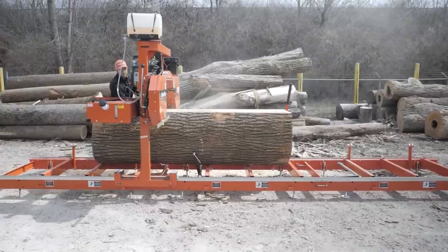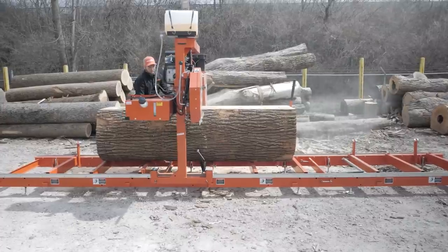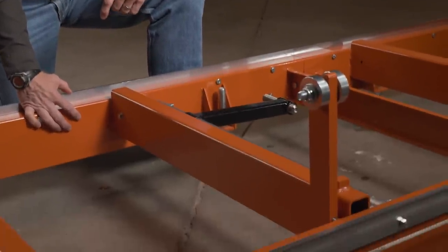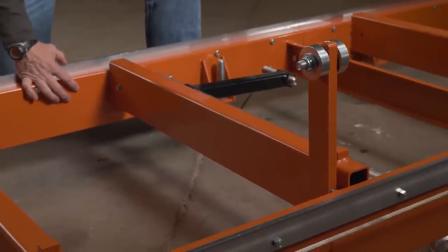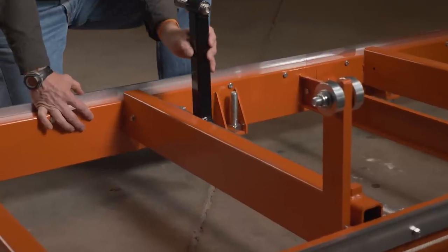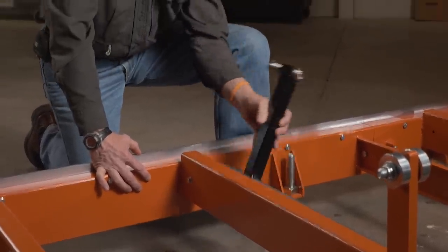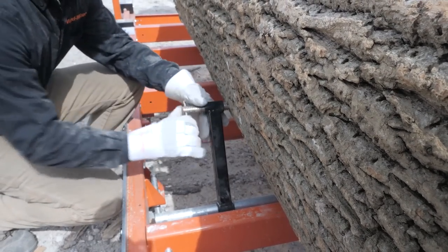Additional track sections can be added to go virtually unlimited length — each track adds 6 foot 8 inches in cut length. Taking a closer look at the bed rails themselves, you'll notice it comes standard with six side supports with rollers on top that assist in turning and handling of the logs, and there are two log clamps that are adjustable in and out and up and down, which secures the log between the side supports and the clamp for processing.